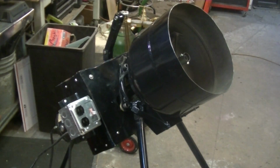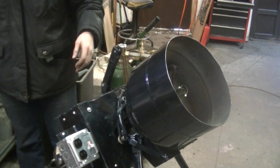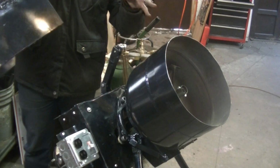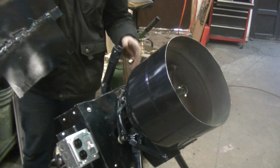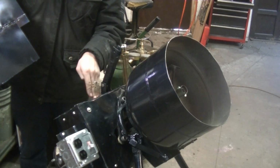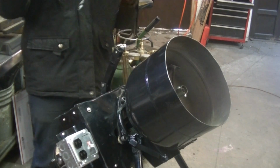That's awesome. So we have one more piece, and that's the little roof. Again, I don't remember if I said this, but I'm going to be keeping this thing outside, and I'm trying to stop the water from getting in. The biggest reason for that is keeping the water out of the motor. The number one failure for electric motors is shot bearings. This is kind of at the perfect angle to let the water go into the motor. So that's why I'm doing all I can to block this area, and I want to block as much as I can.